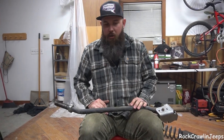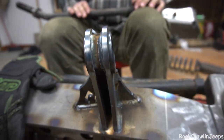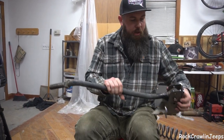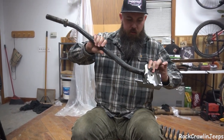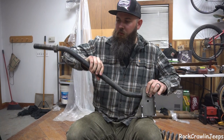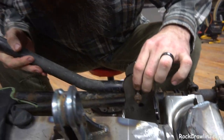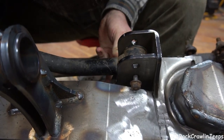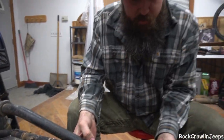I've been under the hood for quite a bit. We've got our upper control arm mounts on. I was even nice to Dylan and finish-welded the rest of the tops of those. Now we're at a little fun part. We've got our track bar — I pulled the one off the Jeep. This is not the bar we'll be using, but it is the same diameter and the same bushing size. So what this does is it jigs in here just like that, and that is essentially exactly what that'll look like.